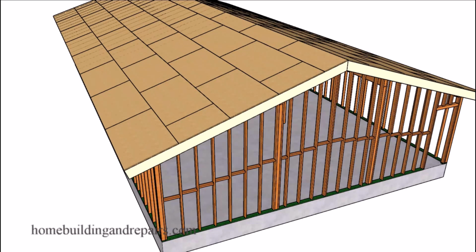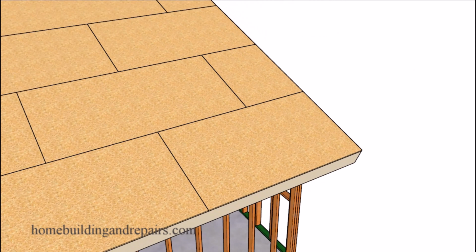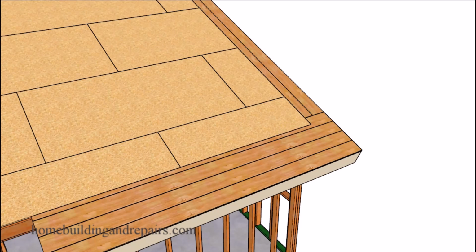In this video, I will provide you with another way you can save a few dollars when building a house, using tongue and groove or shiplap instead of plywood or OSB for the overhang. And in this example here, we have 1x8, but you can see that we have a small strip here. And this is only going to be if you have to break the sheathing over a block and have a specific length for the roof overhang.